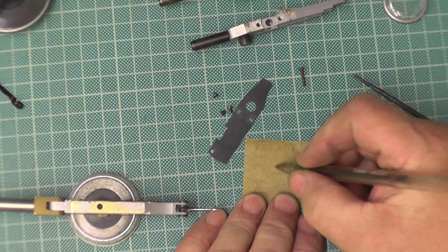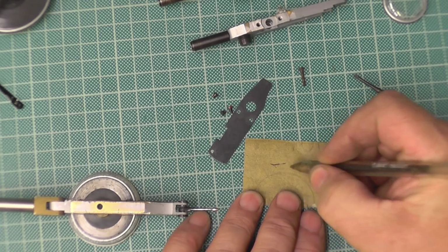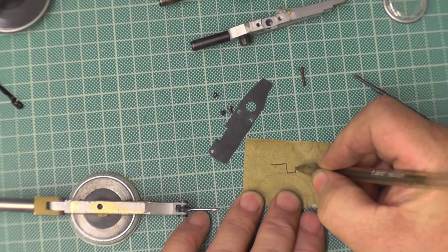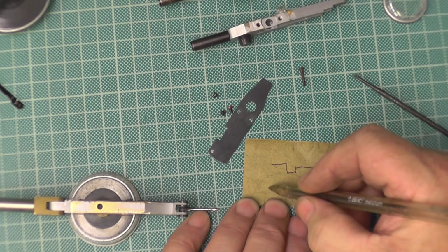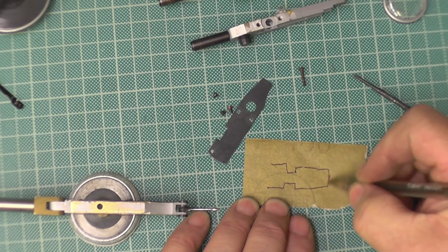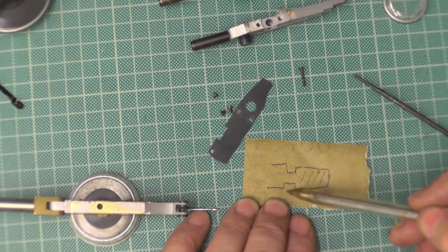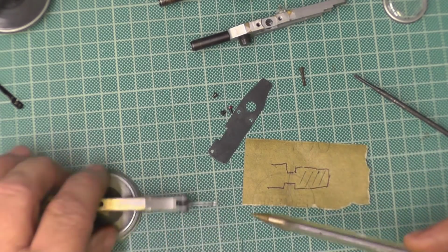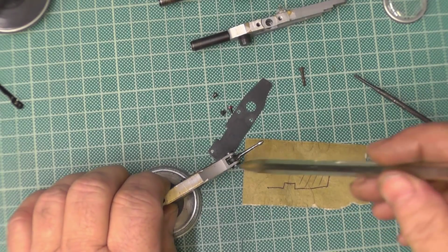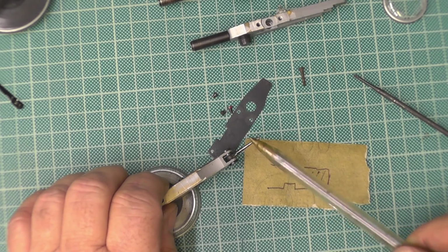And imagine, I was going to do a drawing before I came. This is the stylus, this end. It has an undercut, then you have the threads. Stylus, undercut, threads. This is the threaded bit here. Nine times out of ten it snaps there when it's in the main body. Now the bit that it screws into is hardened, and the stylus itself is hardened.